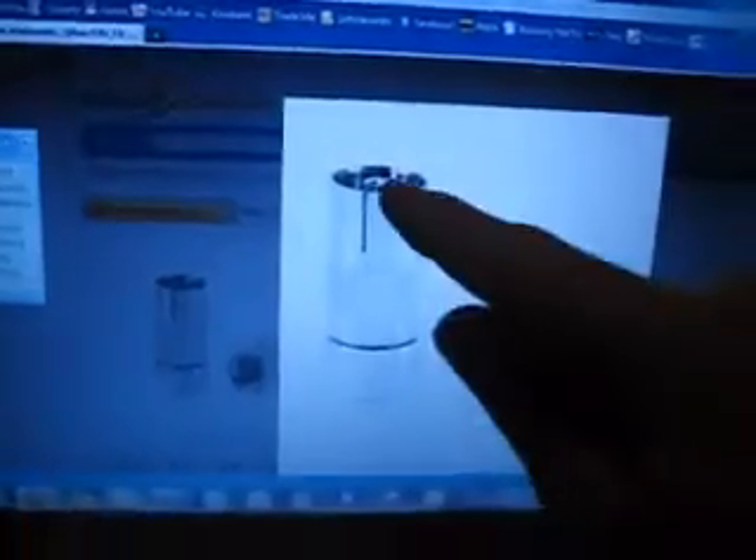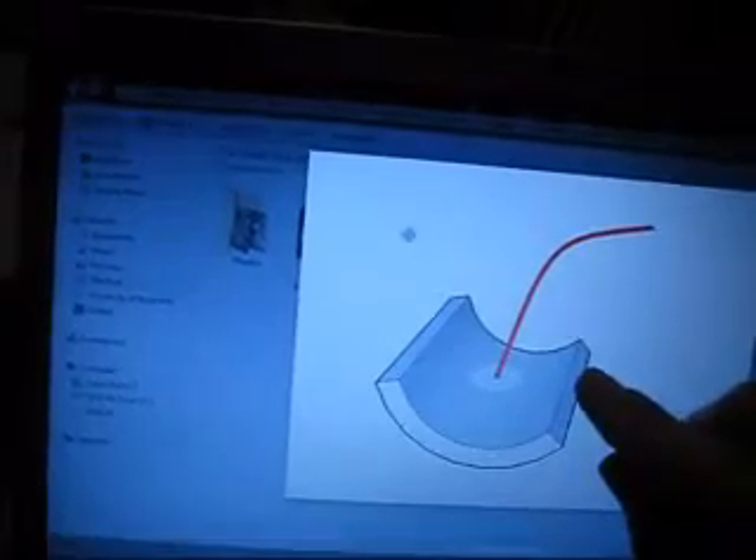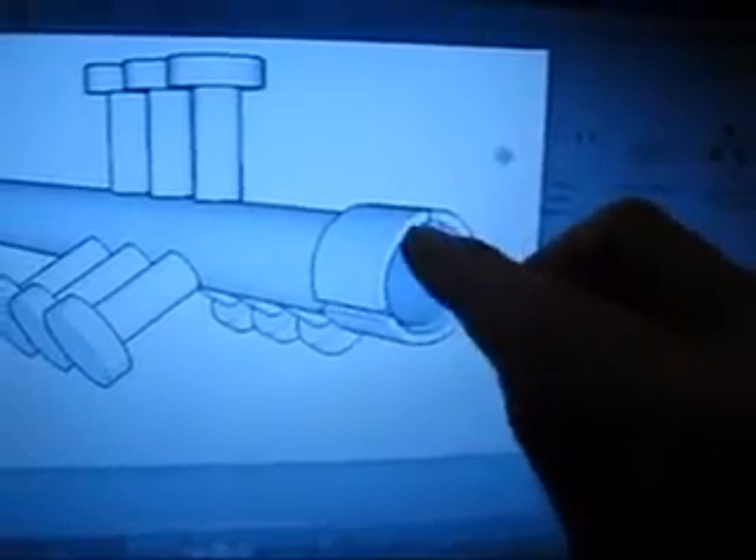After making those cuts I was left with three 120-degree sections — like that. I was left with three parts like that, 120 degrees each part, because obviously it was a three-coil motor. I have nice straight cuts down there to create a very small gap in between each section of the commutator. Back here you can see that on the Google SketchUp render view — there's a little gap through there.